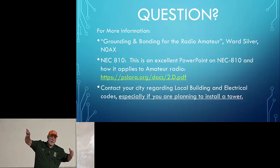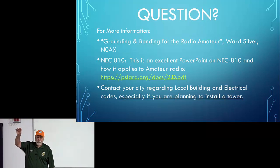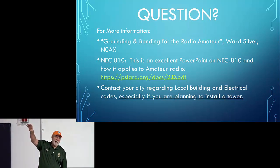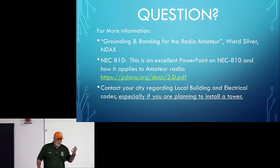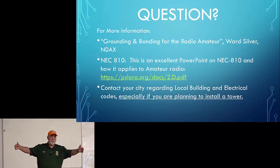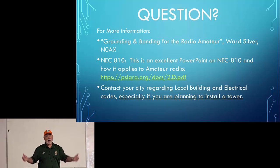So we transformed that 250 ohms of that long wire down to around 60 ohms where it connects to the coax, and so the transmatch only has to deal with that slight mismatch instead of this huge mismatch. Imagine the mismatch we'd have if we were looking at a half-wave antenna where it's 2,500 ohms at the feed point connected directly to a 50-ohm coax. Huge loss. The other thing that affects loss in transmission line, of course, is the frequency, which infers that it's also affected by the length of the transmission line.